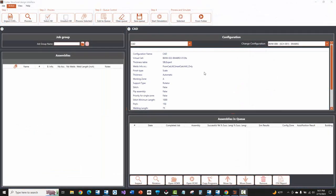Now we're over here in the Cortex software provided by AGT. The first thing you need to do is look at what's going to be the import mode or configuration for your processing and simulations. When AGT does the training and setup of your Cortex software, they'll create these different modes and save modes for you. CAD basically means I'm 100% going to be using the welds defined in Tekla and only those welds when I import and process the assembly in Cortex.